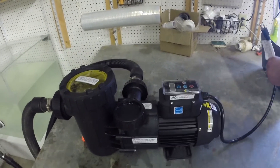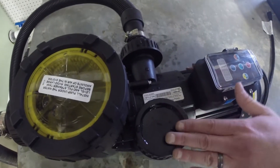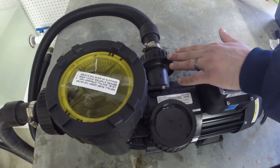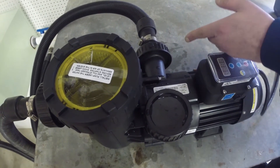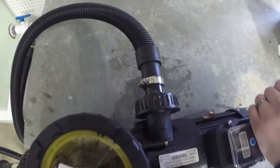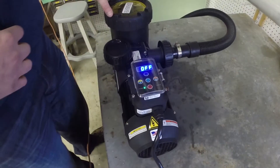The pump is already set up for either a vertical or horizontal discharge for your sand, cartridge, or diatomaceous earth filters. It's a very easy setup — all you're doing is switching the plug from one side to the other. It also comes with your standard barbed hose adapter fittings for use with a hose clamp, or regular union hard PVC pipe connectors for a more permanent setup.